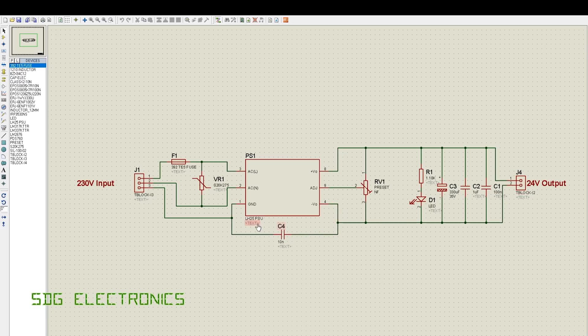We've also got this component here bridging between the AC ground and our zero volt output. I've nominally drawn it as a capacitor but this could be a resistor or even just a plain wire link. What we need to do when we build the PCB up is test whether the output of this device is floating, because what we don't want is the outputs floating up around 90 or 100 volts AC. Although extremely current limited, we want to be able to safely connect this to any electronics on the output. If we see it floating up and it's not internally connected to AC ground we can just bridge these two nodes and that problem will be sorted.